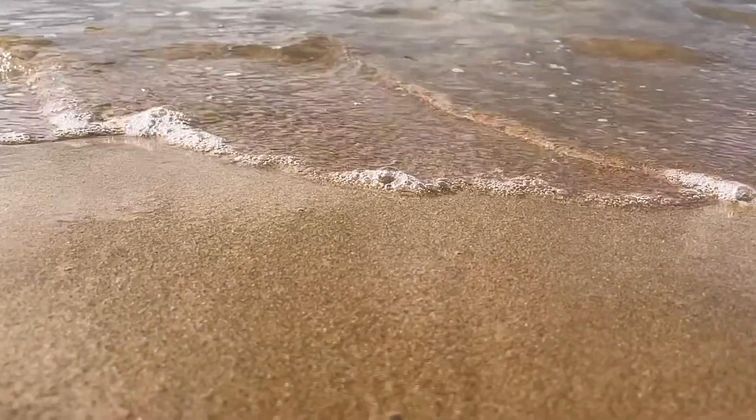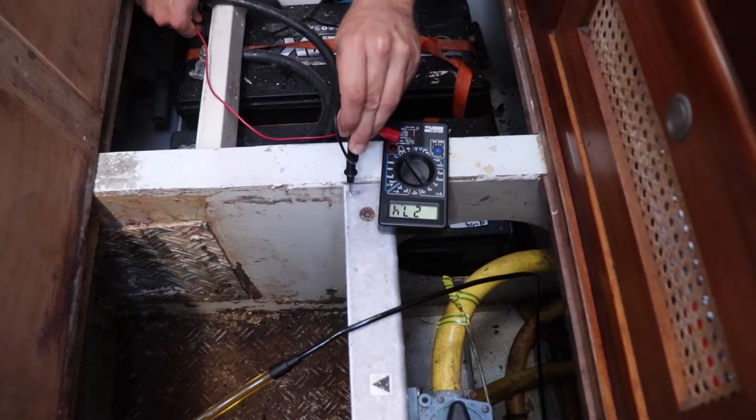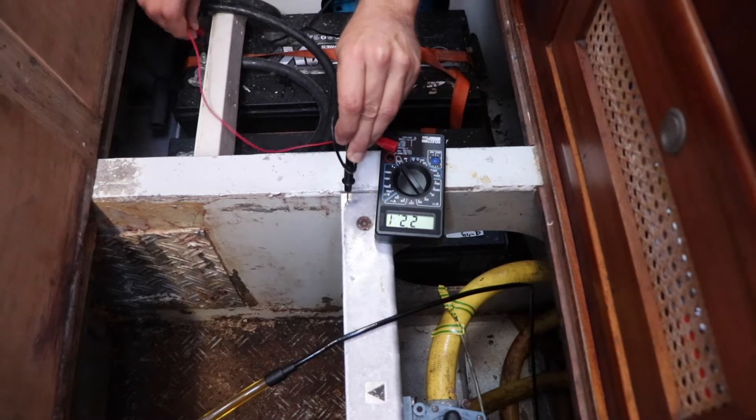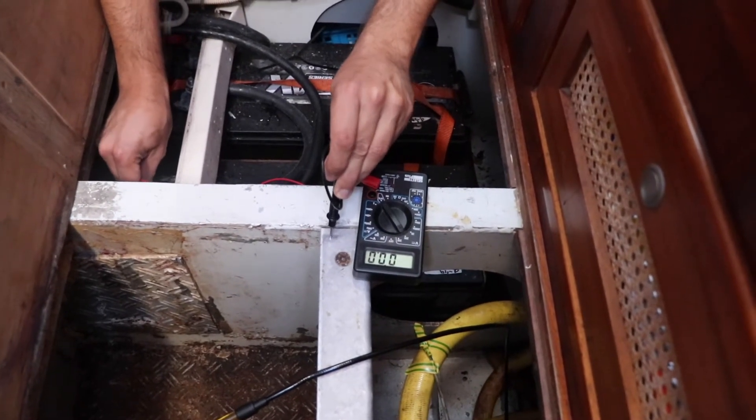When the light lights up, you have a serious issue. We checked the voltages, which is easy to do but hard to interpret when you don't have a lot of electricity experience. The plus was giving us around 20-25 volts, which is good. The minus was giving us zero volts, which we found out was not good — it should be at least 24-25 volts.